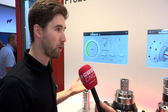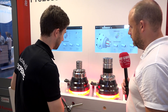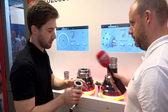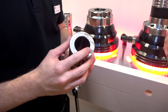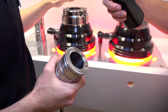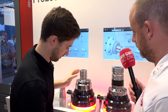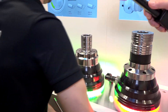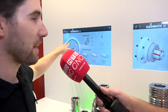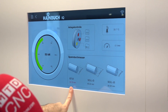Now let's do the same with the false part. We are simulating a chip — a chip on the plane. It's not a very big chip, is it? No, it's a small chip, but it's very easy to detect here. We are already detecting this small chip. And we have the wrong diameter now. So now we again have the right force, but we have detected a chip and we have detected that we have the wrong diameter here.